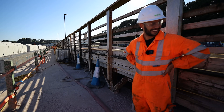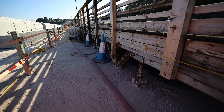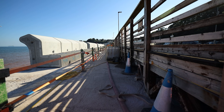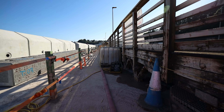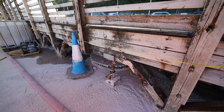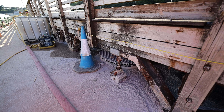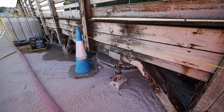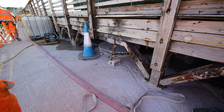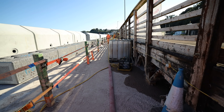It's bizarre walking this area having known it for so long — I've taken so many photos and videos underneath there and got caught by the waves so many times. What happens now is we land the promenade unit roughly somewhere around here, and then in the next phase of work when we come to do the platform works, the timber platform gets stripped out, the catch pits get extended up into the platforms with a lid for access and maintenance purposes, and then that will get infilled with concrete with the new surface on top, running straight down into the L units. They'll be accessible for maintenance.